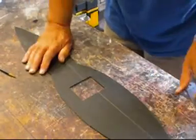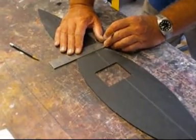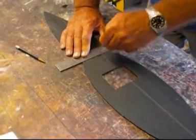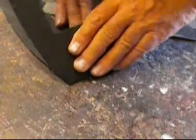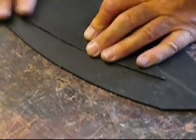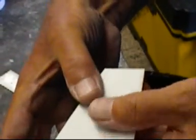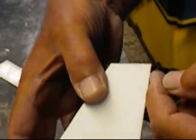On the opposite side to the one we've marked, we're going to make the first bend. It's important to try and get these at 90 degrees to everything else, otherwise it doesn't work. Get the second bend so that this is flush with that, and then the top is flush again. So when you make the second bend, it's got to be the thickness of the Corex inside that dimension.